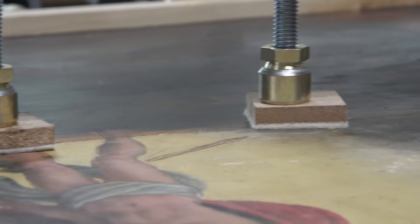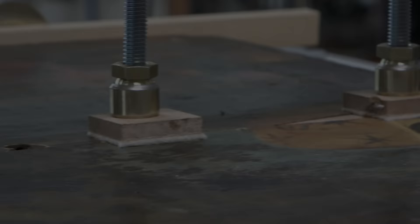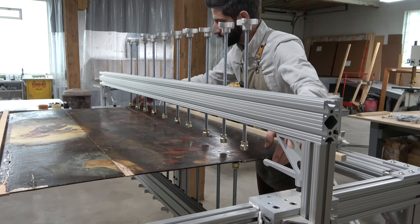As the camera goes across this joint, if you look at the raking light, you'll notice that it continues across the joint, which indicates that we have a really even bond. We can't plane the surface down, we can't remove paint to get it flush — we can just do what we can. After a few days in traction, we've removed the panel, checked the joint, and now we're ready to move on to the complex big kahuna.